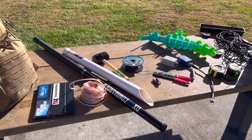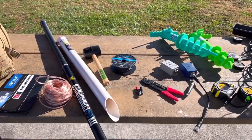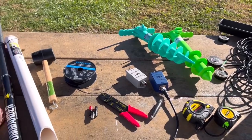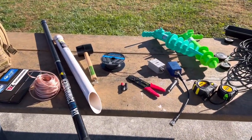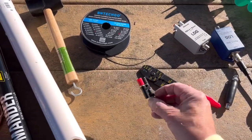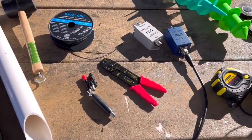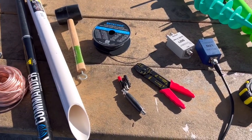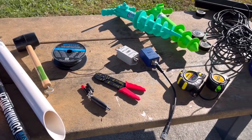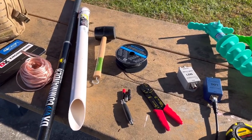I'm going to build an antenna I call the 17-5 — basically a vertical 17 feet 5 or 6 inches, so about 5.33 meters. It's multiband, covering 20 through 10 meters, possibly 6 meters too. For a quarter-wave ground plane, I'd put a quarter-wave driven element up in the air and then counterpoise wires underneath. I typically use at least four, maybe five or six counterpoise wires, about five meters long each. Anyway, I'll quit rambling and start cutting some wires.